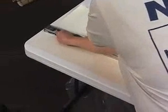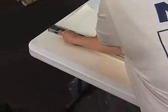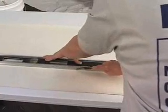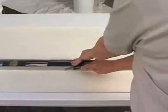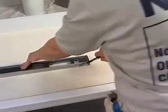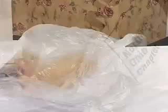With a single edge razor or snap knife, press the blade against the level and cut the paper, running the blade along the edge of the level. If using a razor blade, hold it between your thumb and forefinger. Move your hand, holding the next spot down before you slide the blade along. Cut slowly and carefully. Don't use excessive pressure and always use a new blade.